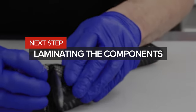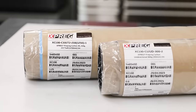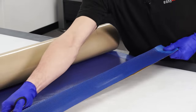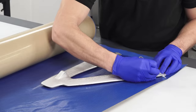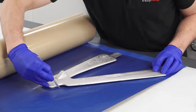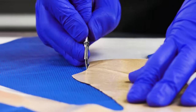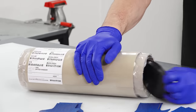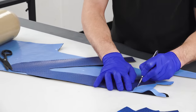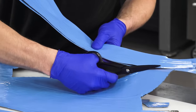While the PVA is drying, we can start preparing the materials for the parts themselves. We'll be using prepreg carbon fibre for the layup — specifically the Xpreg XC130 system. Prepregs are a form of carbon or glass fibre reinforcement where uncured resin has already been impregnated into the fibre. This resin can remain tacky for days or even months at room temperature, but will cure fully in only a few hours in an oven. I'll use a woven 210g material in both the induction tube and the wishbone, and then multiple plies of 300g unidirectional reinforcement for the wishbone where the strength is required.